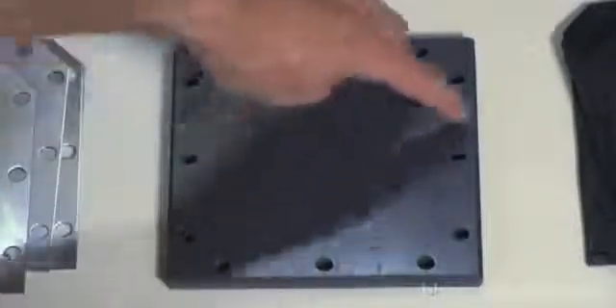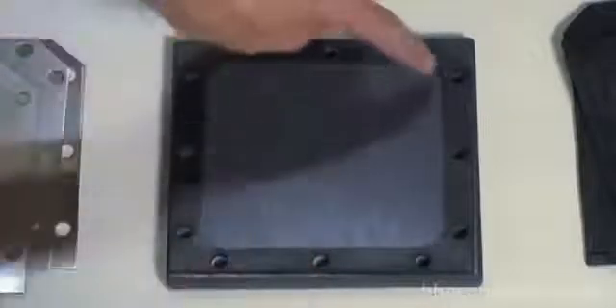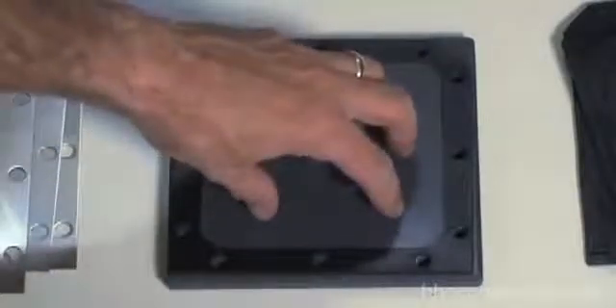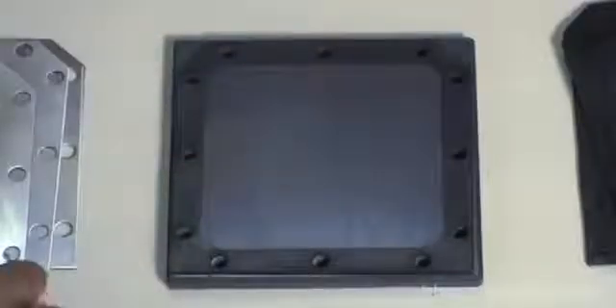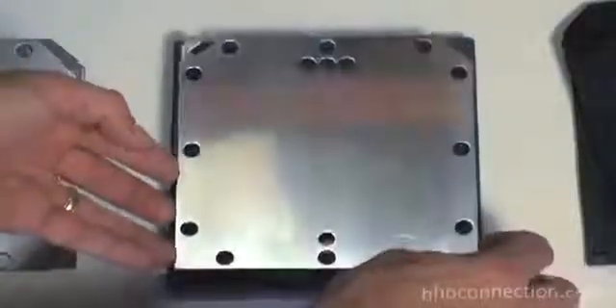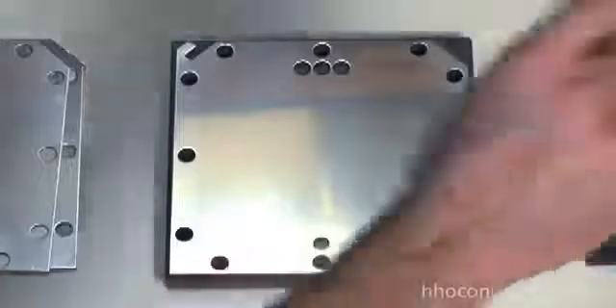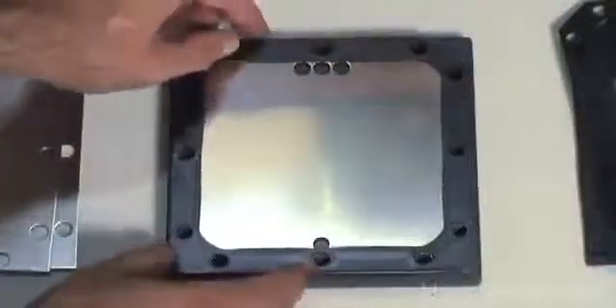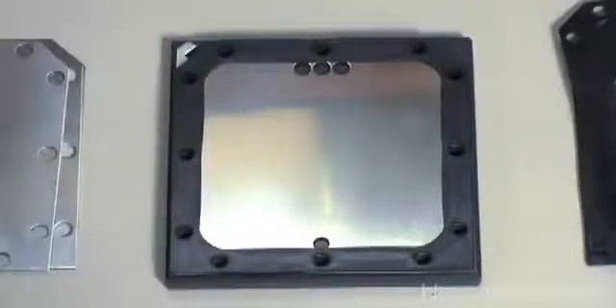You've got your end plate that normally has bolts going through these outside holes. All you do is take one of your gaskets and lay it down — it creates a little cavity in the middle, one sixteenth of an inch deep, that allows the water to flow in that cavity. Then you take one of your stainless steel plates and lay that on top, then grab another gasket and lay that on top. You continue this until you get a big stack of all these plates and gaskets.